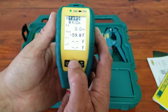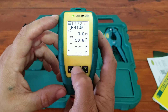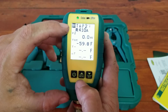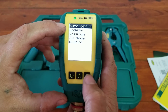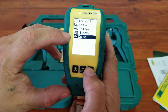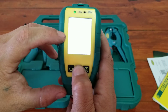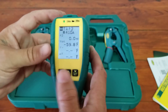If you hold in the menu button — hold that in for one second — you can toggle through your different options, changing Fahrenheit, Celsius, PSI, bar, and all that good stuff. If you want to go to the little drop-down hamburger menu, you just hold the set button for one second, and that will bring you into this menu. For instance, if you needed to zero your pressure transducers before you hook them up, that's where you would do that. And when you want to back out of this mode, simply hold the menu button for one second and you're back out. Definitely very cool.